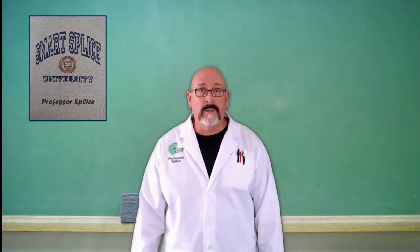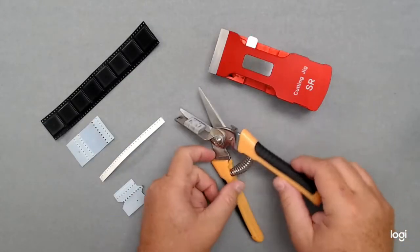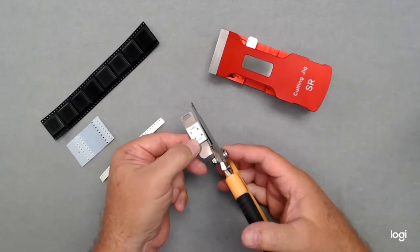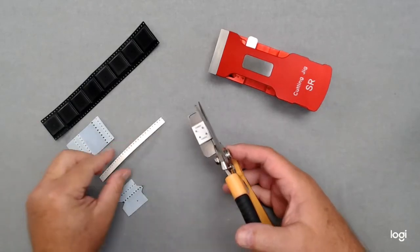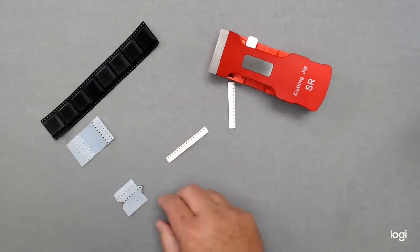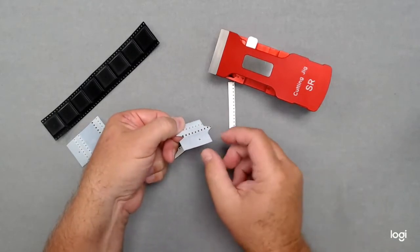Let's go take a look at the video. I'm first going to show you how to do an 8mm punch tape using these scissors that have the two alignment blocks on it — one for 4mm pitch, the other for 2mm pitch. This tape uses the 4mm pitch. Cut the tape and we go to the splice, which is the alignment jig splice.